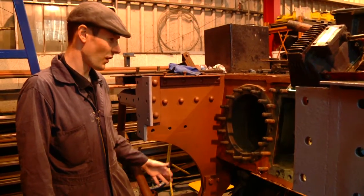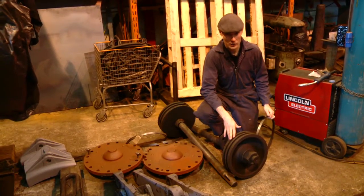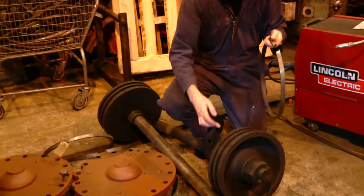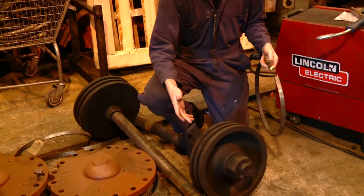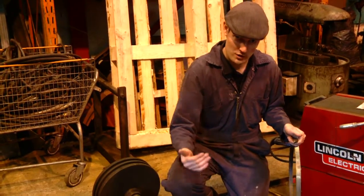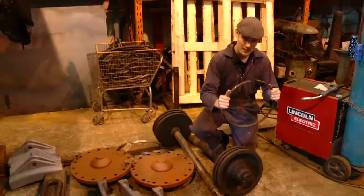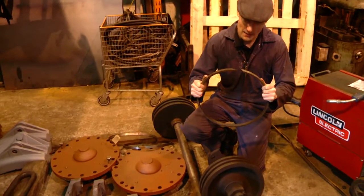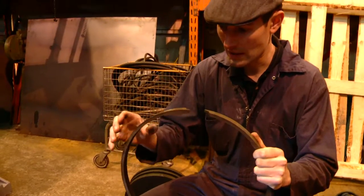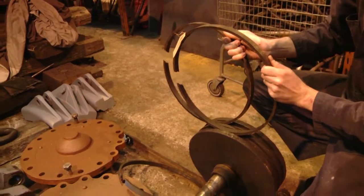This is the piston, one of the main ones for the locomotive. As you can see, it also has two piston rings — these metal rings fit into the grooves here and they provide a seal when the locomotive is in motion. As a result of the motion forwards and backwards of the pistons, these rings obviously get quite worn. They're actually designed to spring out slightly, which allows them to expand to the outside of the cylinder and provide a steam-tight seal.